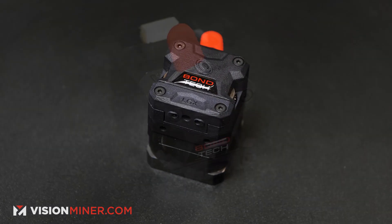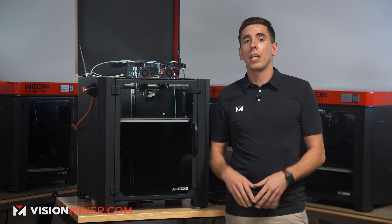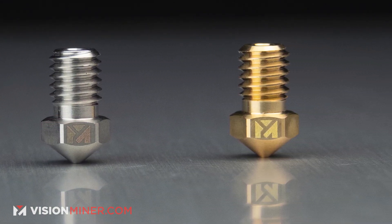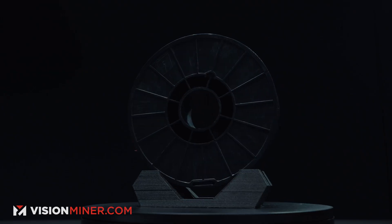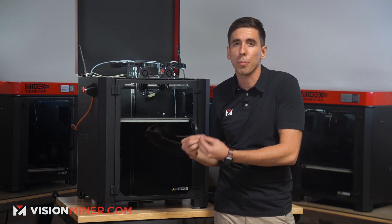Using the best quality on these two components prevents a ton of the headaches you'd normally get in 3D printing. The LGX extruder combines a lightweight and compact design to improve speeds, but mostly it's for the excellent performance — the extra large gears make sure your filament isn't slipping during printing, ensuring consistent extrusion and more consistent parts in production. The hotends come standard with E3D V6-style hardened steel nozzles, and it's a 1.75mm open material system, so you can use any filament on the market — high temp, low temp, carbon fiber, glass fiber, even metal-filled materials from BASF like Ultrafuse, where you can sinter it after and get solid metal parts.